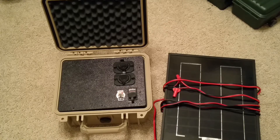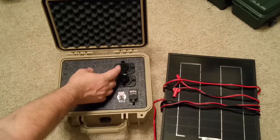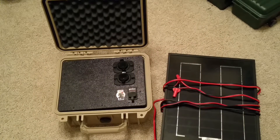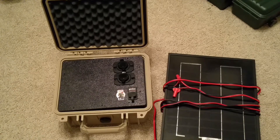This switch is a weak spot — I may change that out for a waterproof ruggedized switch, but it's doing the job for now. I went with a dual-battery system in a big Pelican 1500 case with an AC inverter that I'm still working on — I'll show you in another video. That one does AC with two USB and two 12-volt outputs. The AC has a fan system that's powered when the AC part is turned on, drawing air in and out like a computer case so it won't overheat. There's also a thermal protector on the inverter.